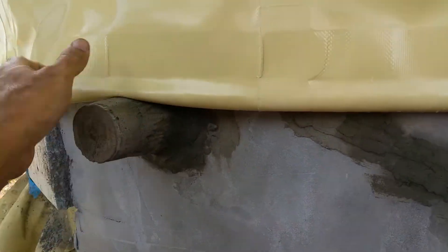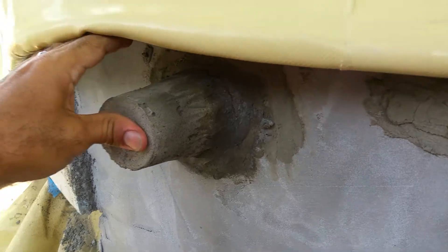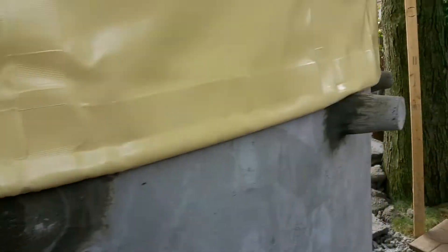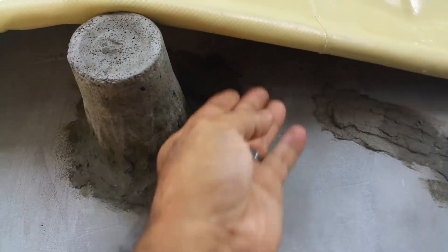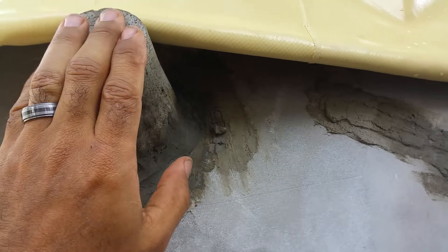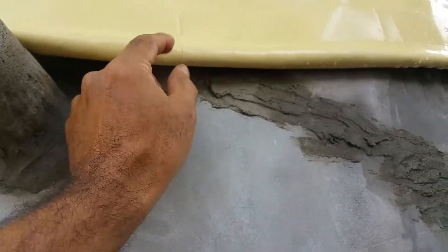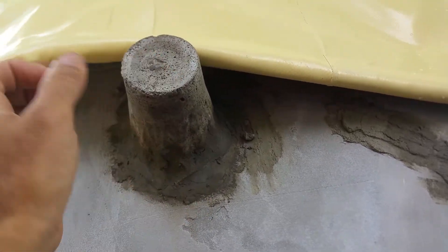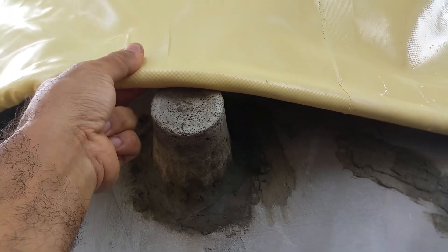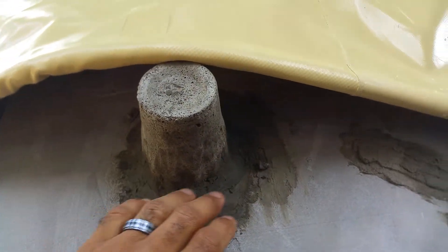What I did here was create these spacers using plastic cups as molds. The spacers have been put all the way around the dome and above it, just to keep the gap between the air form and the wall. Without these, the air form would slump to one side — one side would be a foot thick, the other a quarter inch thick. In order to keep that cavity equal all the way around, I put the spacers all the way around. Once I finish pulling the air form over it, I'll have an even gap and this entire space will be filled in with aircrete.